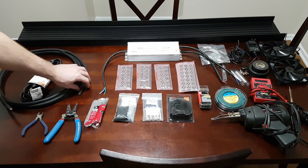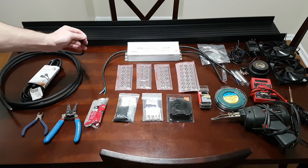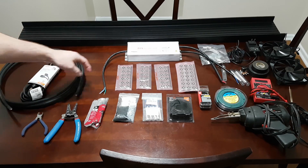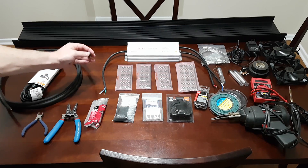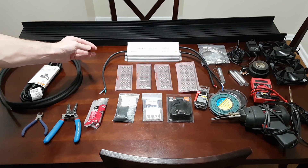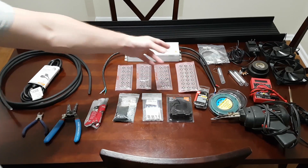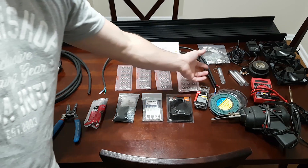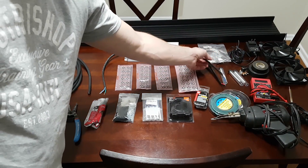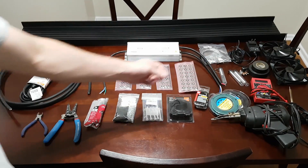From there, I got this cable — this is four-conductor 14-gauge cable, so there are four 14-gauge wires in here. This goes from the two leads on the driver up into the fixture itself. Two leads are for the positive and negative for the LEDs, and the other two leads are for the potentiometer. The potentiometer will be mounted on the fixture itself, so I'll be able to dim the fixture while standing and looking at the tank, which will help dial it in more easily.